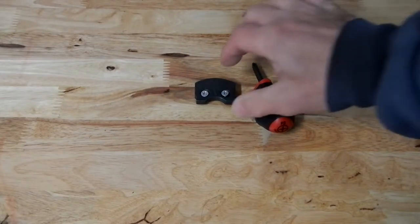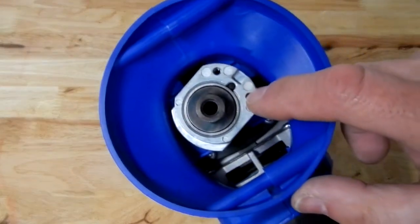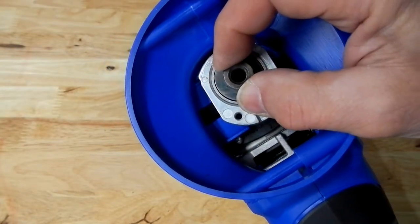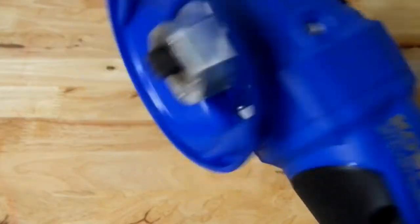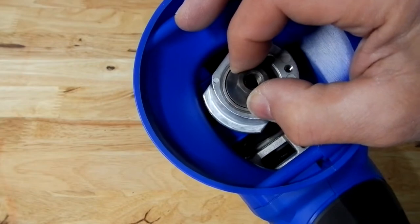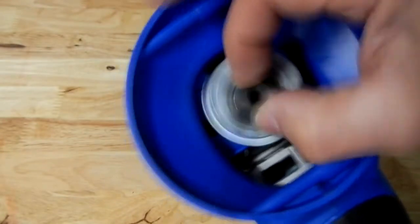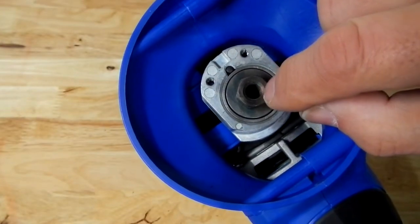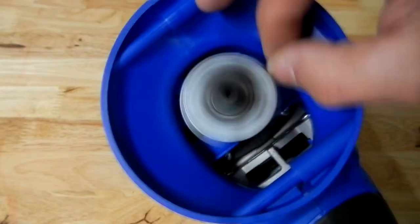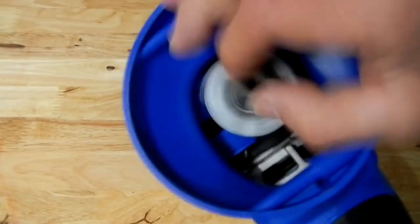Now, to show you better, I've taken off what I'll call a counterweight on the opposite side. Now, when I put my hand on this spindle, watch. Let me slow it down to number one. You'll see that this is actually 8 millimeters offset, so it's creating little circles around this. I wish it would go a little slower, but I think you can see what I'm talking about.